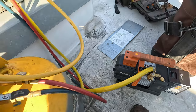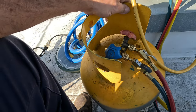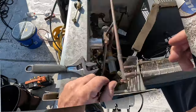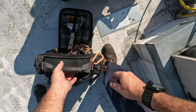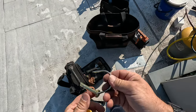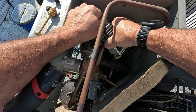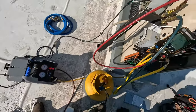Got the 4 CFM NAVAC pump here, pulling through the testo gauges. I just want to get her into a good deep vacuum — there's no moisture in the tank. I notice I'm not pulling any liquid out, so we need to kick on that solenoid — the liquid solenoid. We'll get our magnet out and stick that through the actual coil so that if we do have an accidental energization we should be good to go. Put the magnet on it so it doesn't fall out — and look at that, now we're pulling liquid.